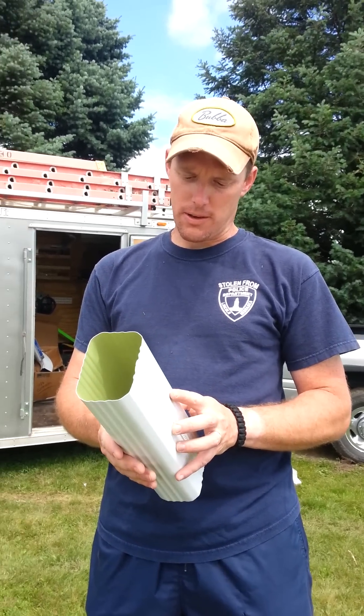Today I'm going to show you how the ELF elbow machine works. We've got an electric elbow machine — it's 3x4 A's and B's and 2x3 A's and B's. We've cut some blanks already: one for a 24-inch overhang for the eave, and another to show you an offset. We're going to bend an inch and a half offset, which gives you a very small step out but shows you the capability of the machine.